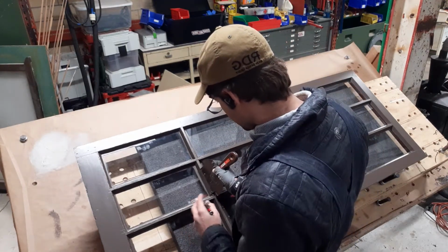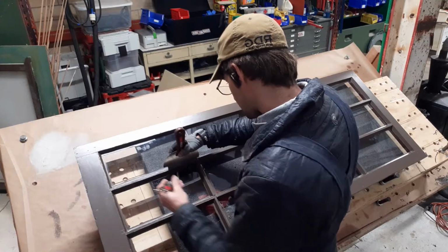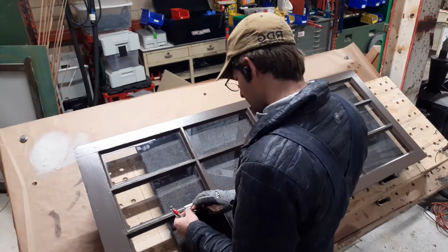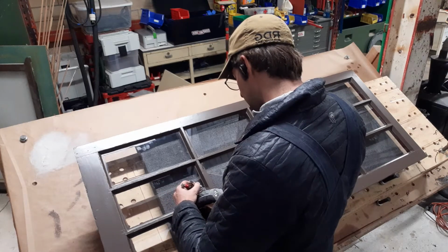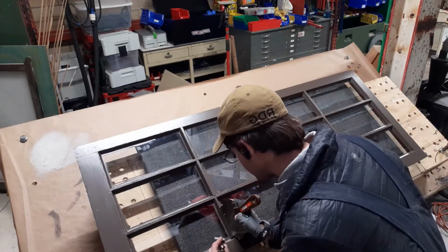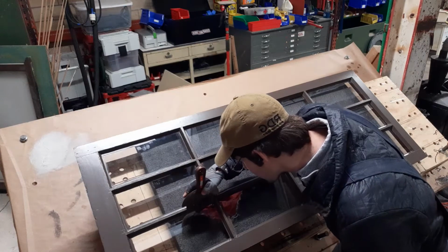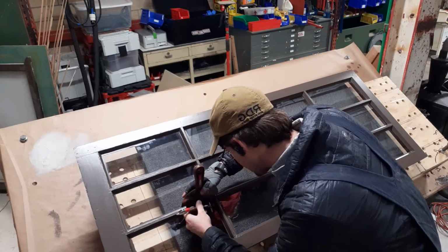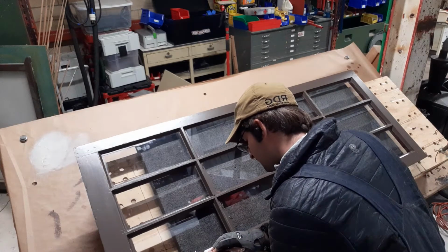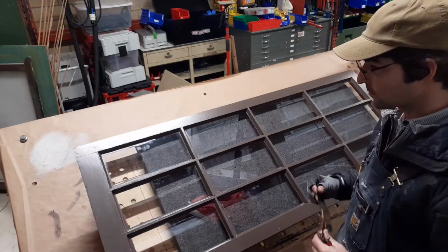It's gonna keep your work surface clean. You got little paint ribbons. You cut it off once, you don't want to cut it off twice. And whatever other little remnants may linger behind. If you notice, when I was glazing the window on the first go round, you'd always have a little bit of oil in the corners from the glazing putty, and it's really hard to remove from the pumice because you didn't want to really mess up your corners with the brush when you're dusting off the pumice. This razor blade, because it's always predominantly sharp because you're working on clean glass, is able to remove that. If you had oil on this frame because you didn't pumice it after glazing, this would be a much more difficult, tedious story.